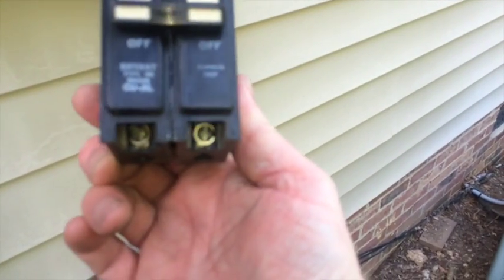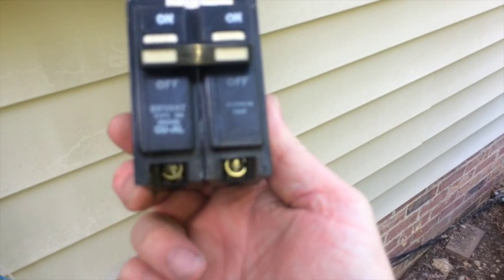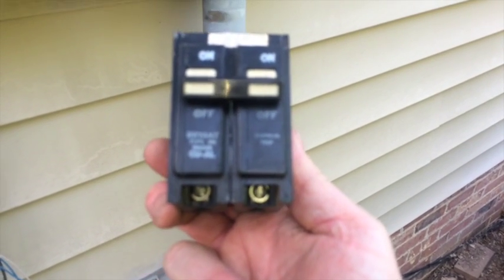Checked my lugs, and so what I'm going to do is go get a new breaker and replace that, and remove the little section from the pole connector on the inside panel, and then go ahead and replace it and make sure everything is working. So when we come back, we will put the breaker back into the panel box, rewire it, and then start it up, and hopefully that will be it. So Scott with a day in the life. We'll be back in just a bit after we get the breaker.